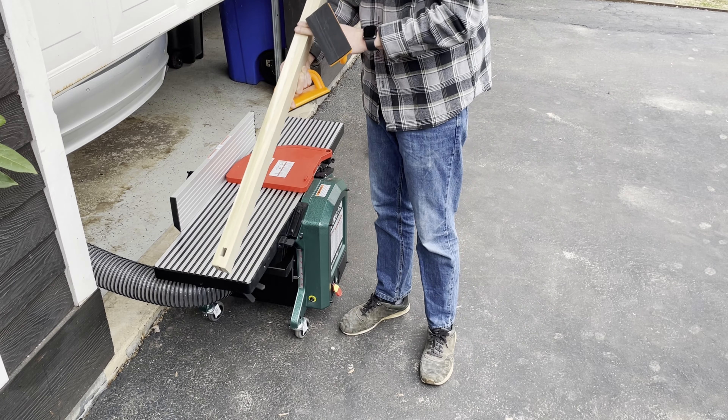You can see it's a little bit of trouble sometimes just getting it in there, especially if you've got a little warp in the board — it's a little tight to get into the rollers. After a couple passes I got a good look on it. I want to make one last pass with a 32nd of an inch — one click of the knob. It makes four clicks around and that's one eighth of an inch. Supporting it on the backside also helped with any snipe on the ends. Here's a close-up look — this bird's eye maple, on a lot of planers it would chip out around the eyes, but it's got a nice 3D effect.